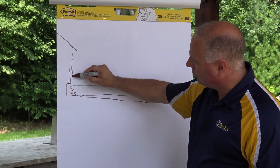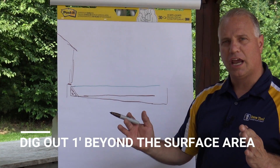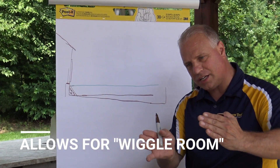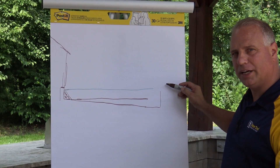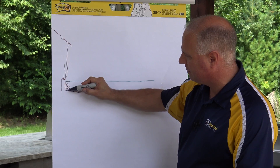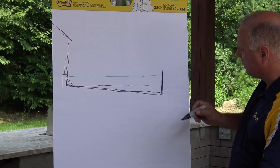Your foundation is here and your framing is up from there. Generally I go a foot beyond the base: if I'm doing a four-foot walkway, I dig out six feet — a foot of base on both sides — giving wiggle room for nice flowing curves. Same thing on a back patio: go a foot beyond with your base. Then I'm going to take my fabric and envelop the entire sub-base, ramping the fabric up along my base all the way around.